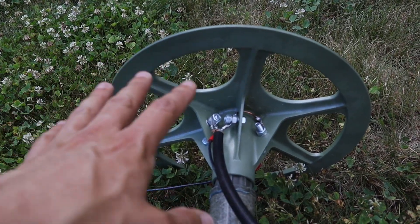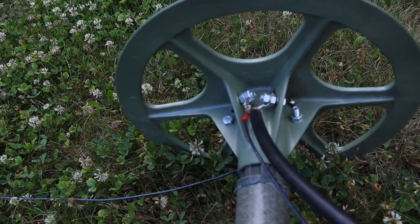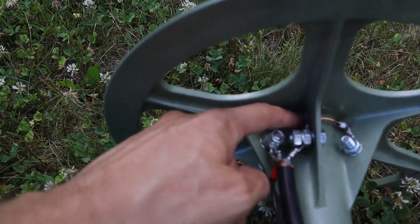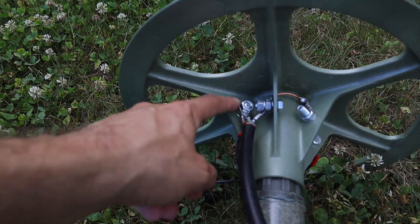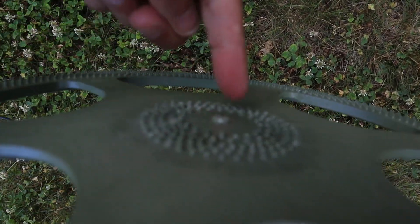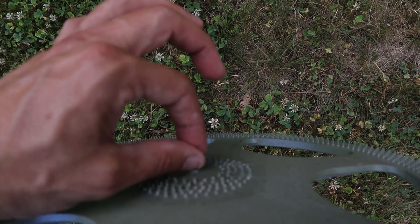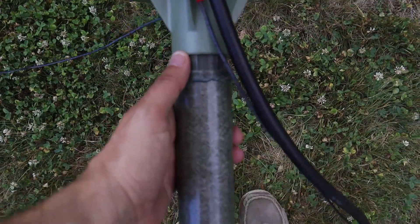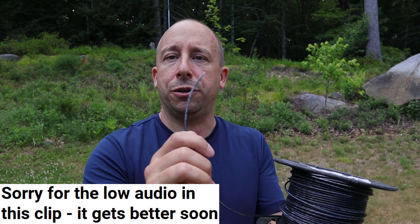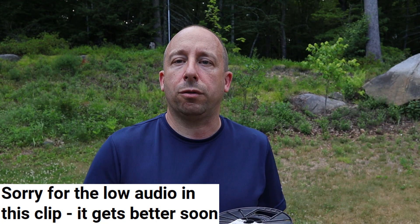I apologize that I didn't record any footage while actually constructing this antenna, but it's pretty straightforward. I just drilled two holes in each corner section of the canopy spreader: one small hole in the very corner large enough to pass the copper wire through, and a bigger hole for the quarter-20 hardware. One thing I plan to do is drill a single hole in the very end of the canopy spreader to put an eye hook so I can hang it from a tree instead of using the poles. The wire I'm using is 14-gauge stranded THHN wire, which you can pick up inexpensively at Home Depot, Lowe's, or any hardware store.